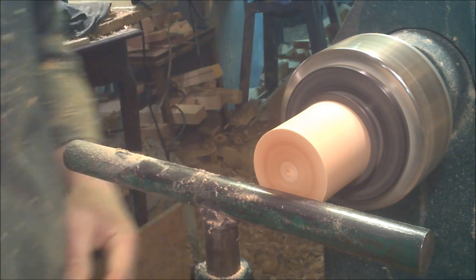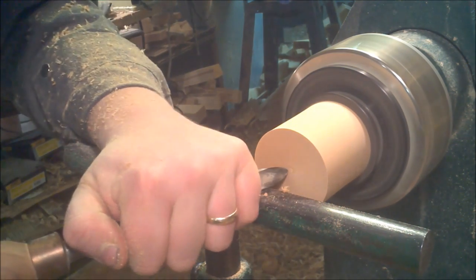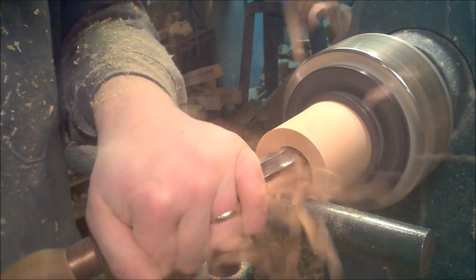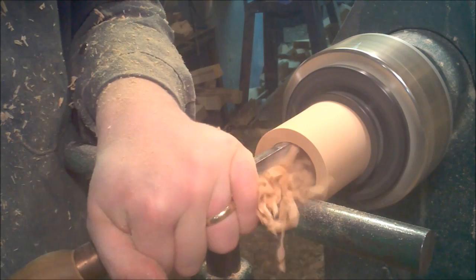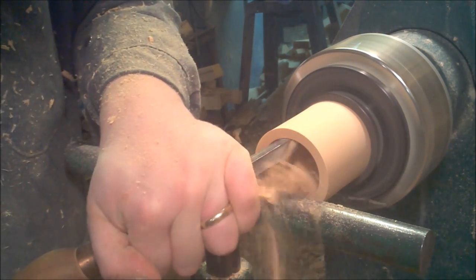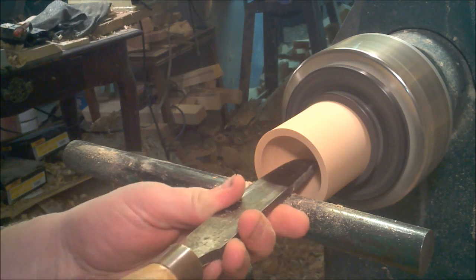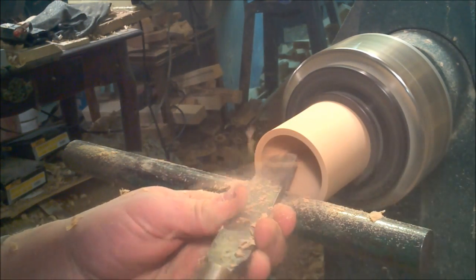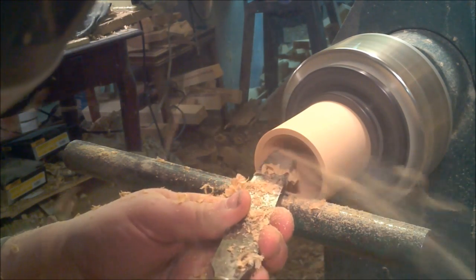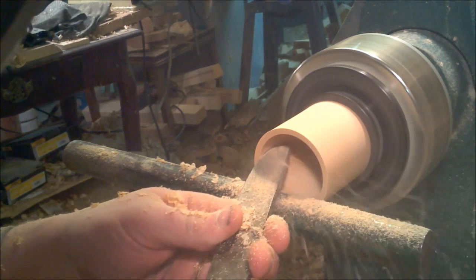Would you like to see a third? Because I happen to have wood for it. Here we go again. You can see the point of the chisel is getting tossed around — it just doesn't matter, just shoot for a relatively even depth. I do more cuts from the center out in this particular project, and the scraper makes up for any differences. The shape of the scraper can easily define your properties. Now my index finger on my left hand is staying still and acting as a pivot point.